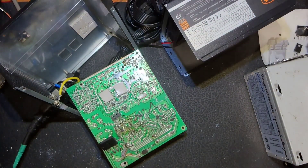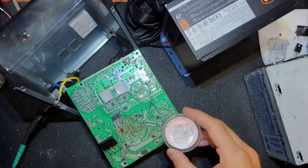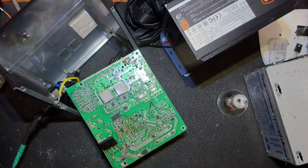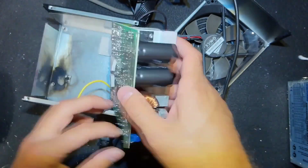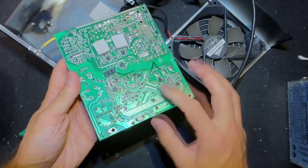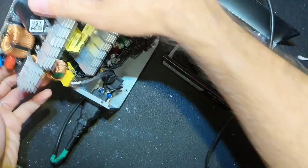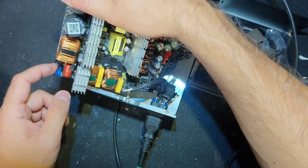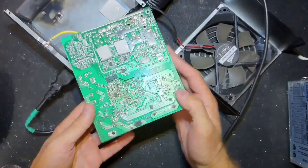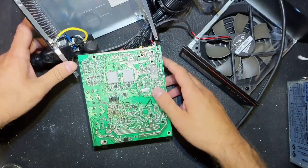Put the transistor in, put the diode bridge in its proper place. The current sense resistor - I decided to put this one. As you can see the transistor is here and the current sense resistor is from that side. I also strengthened the PCB traces, and that is the resistor. I had to drill two holes in the PCB but it's okay, nothing bad with it.